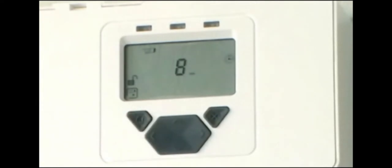The display shows a countdown whilst finding receivers. If one receiver is connected, the countdown will take 10 seconds. If two receivers are connected, the countdown will exit as soon as both receivers are found. The receiver icon at the top left of the display shows which receivers have been found, and the display also shows 2R to indicate the number of receivers found. Press tick to accept the found receivers and return to the engineering menu.